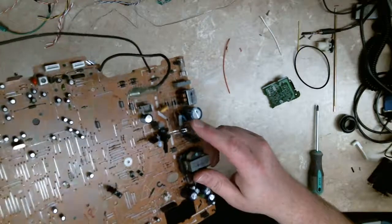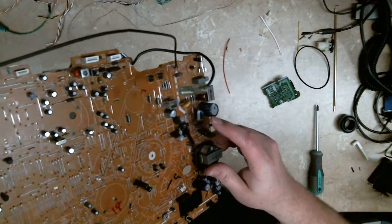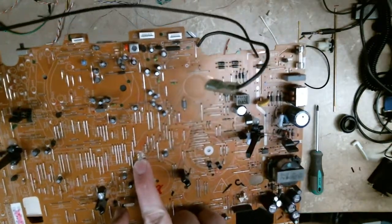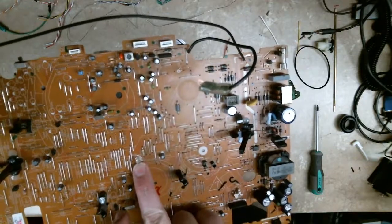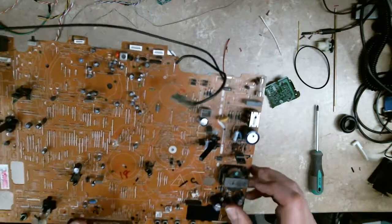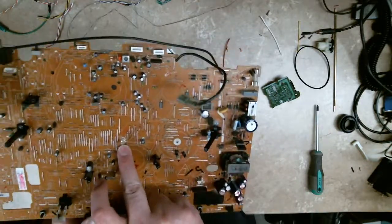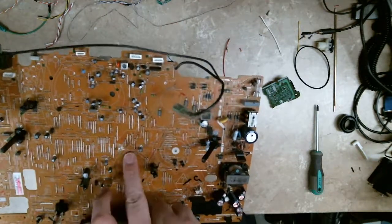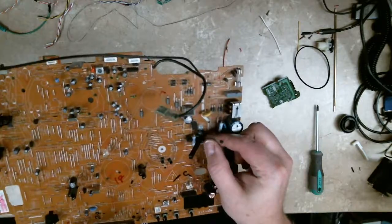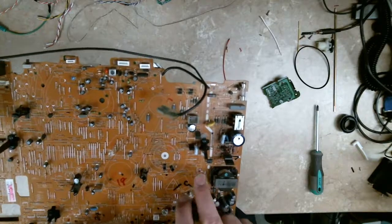So this is functioning as a switch. When the light is interrupted, see this guy right here? This is an infrared LED, a super bright infrared LED. And back there on the loading mechanism and the other gizmos, there were little fiber optic channels that were channeling light through. And these phototransistors were picking up the light from this LED as it passes through.